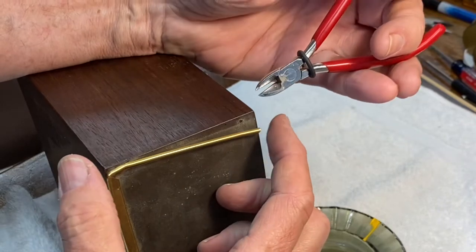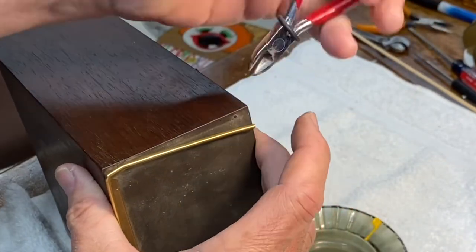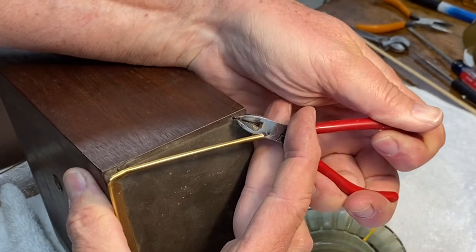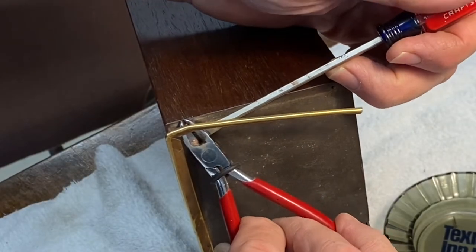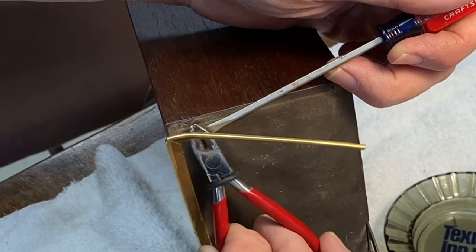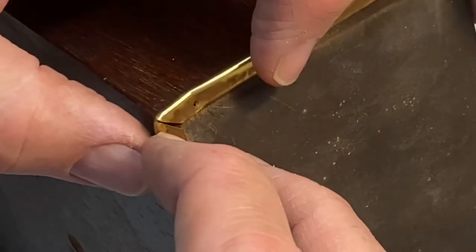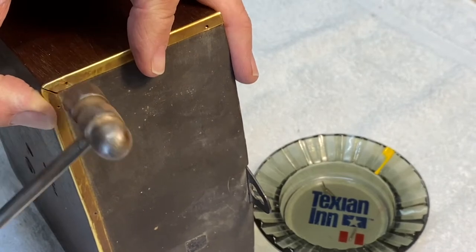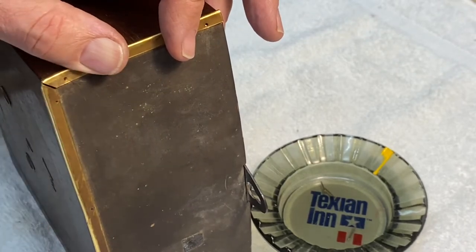I don't want to take it off all the way because this is such thin brass — I'm really afraid I'm gonna kink it or bend it. So I'm gonna try to work these pins out and we'll go from there. There we go — they're like pins almost. I'm going to reposition them differently so they don't need to go back in the original holes, because those holes are probably wallowed out a bit from where the brass tore away. There's a little kink in the brass right there, and I think if I lay it flat and just tap it I could probably get it to flatten out.